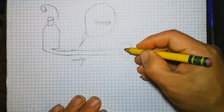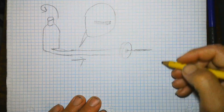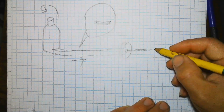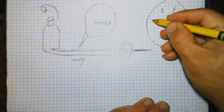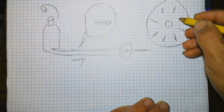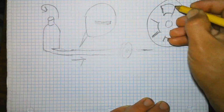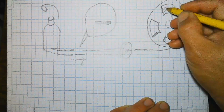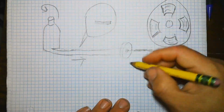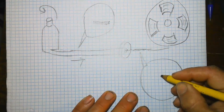Each bottle must be prepared to fit into the jig, the bottom needs to be cut off, and the short lengths of filament that you make must be manually spliced together because one bottle only produces a few meters of filament. And in addition, it doesn't make use of the neck or the bottom of the bottle, which, by the way, is where most of the plastic in a typical soda bottle actually is. But the filament that results from this is apparently pretty performant.